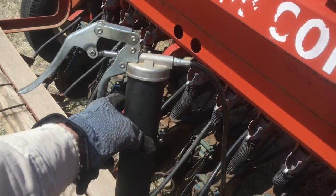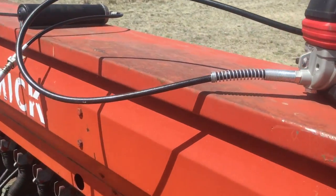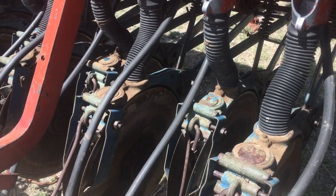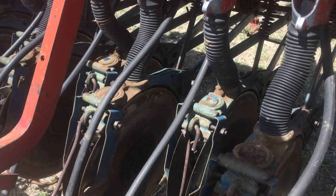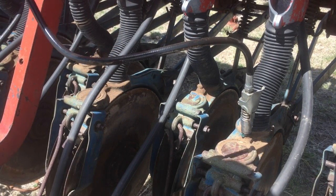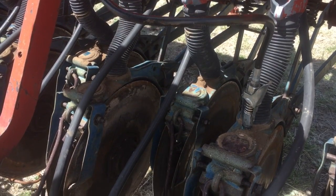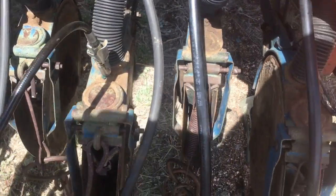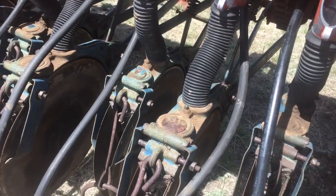This here is a traditional grease gun that we're all familiar with. And this is the Milwaukee M18 cordless grease gun. We're going to start with the good old mechanical grease gun that everybody is kind of familiar with. If you're not, and you're doing any kind of farming or equipment stuff, you really should be. So, clamp it right on the Zerk there - it's airlocked. So first we've got to purge all the air out. It's a little windy out here today. It's a pain in the butt - I pumped it, it's stuck in there, and I just really don't want to fight with it today.